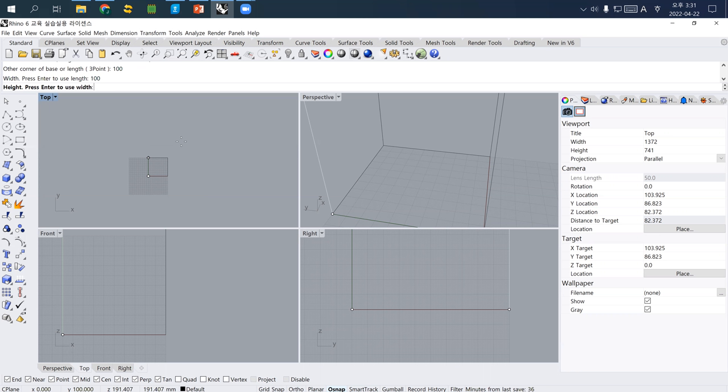When we cut a single piece, we generally set our thickness thicker than each piece because we want to cut through it. But this one, we don't want to cut through it. So we use a little less thickness to leave some material to hold the base. Even though this is roughly 27 millimeters, we just use 25 millimeters. One thing you need to care about is to avoid making a horizontal area somewhere along the glue line or the adjacent line. I would rather use somewhere in the middle so we have a smooth, nice quality.